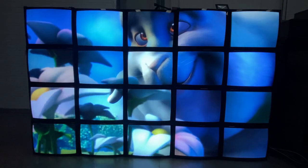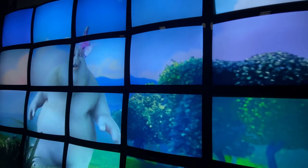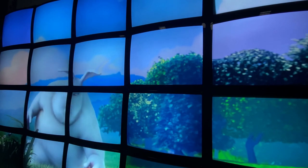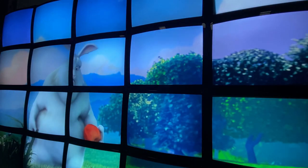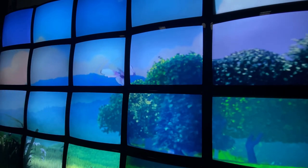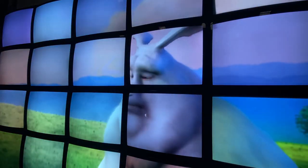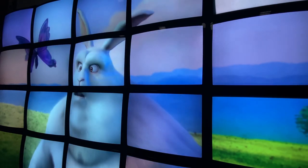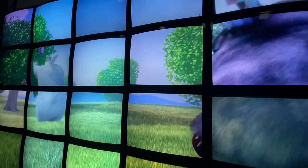You can see the first screen on the second row and the fourth screen on the first row have a slightly different picture — one's too bright, one's too dark or too contrasty. When you're setting these things up you need to adjust the brightness, contrast and other settings to get them all uniform across the whole wall. That was easier back in the day because you were probably using all the same brand of video wall screen, and they were newer with the same amount of life used on them. Now we're using screens from different manufacturers and they've all had different amounts of working life.